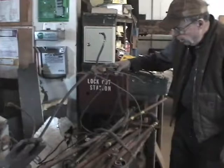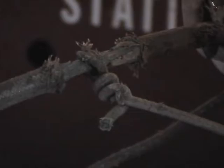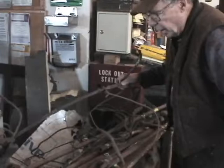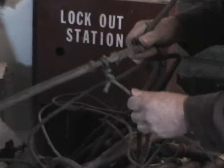There was also a lot of wire, which we're only saving a little bit of just to show what it was. Some of the work done on that car was a little bit primitive. Here's a splice — this is a ground wire, fairly substantial, that went from one end to the other. The current from the motors, lights, and compressor had to go through the ground wire, then to the car bolsters which conducted electricity to the track and back to the power station. Some circuit — I think it was either the headlight or the heaters — was attached with this very simple, very ineffective splice.